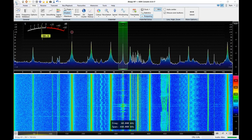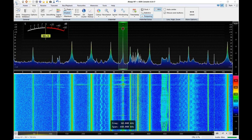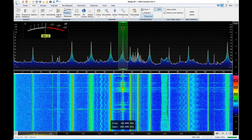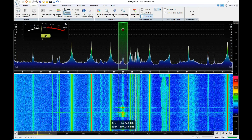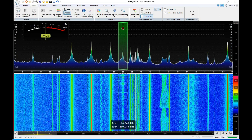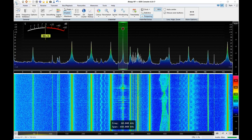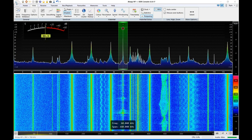We're on a different antenna tonight. We're tuned to a center frequency of 60 kilohertz, and this antenna is a loop that is 44 feet in circumference — 11 feet on a side. It's a diamond-shaped loop, 10 turns tightly bound together, resonated at 60 kilohertz. The signal you see in the very center of the screen is WWVB.